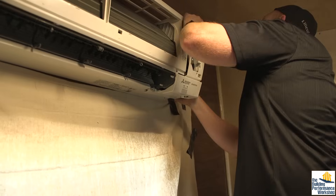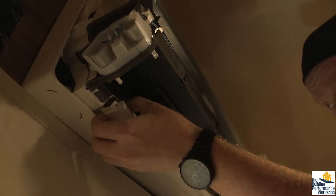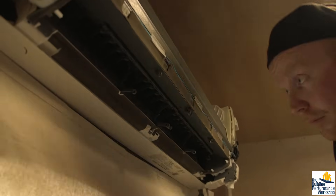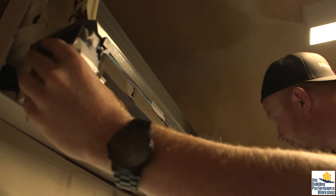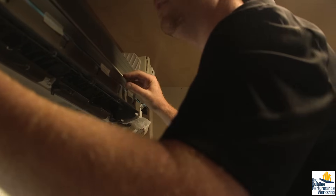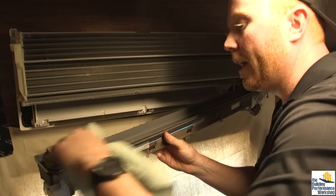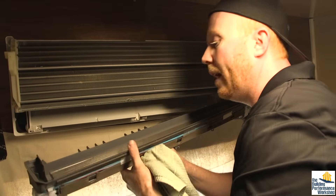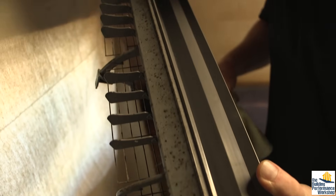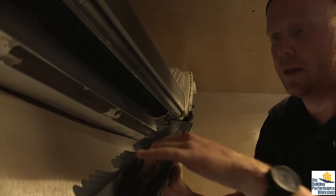You can see that this part is loose right now. Keep in mind a lot of these things don't have anywhere else to go but dangle — and that's unfortunately the way it is. And the drain pan — this is the drain pan right here. You have to make sure and look to see that it's completely dry. We're in Phoenix. Is it completely dry? It is not — there's a little bit of moisture in there. We have the indoor coil right here.